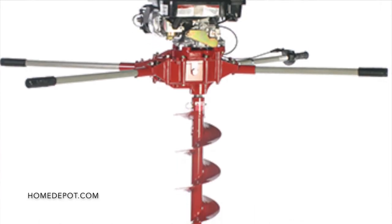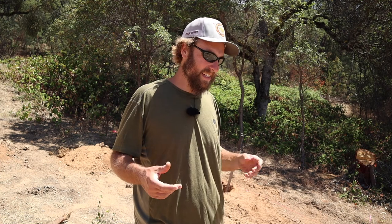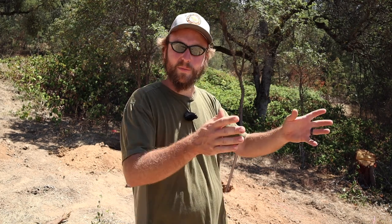And then your two-man augers, you're gonna be able to step up on your bit size a little bit, probably get a little bit more leverage with two guys pushing down and also holding. And that's gonna work better in your somewhat rockier soils and situations where you're doing maybe more holes than you would do with a single man auger, and it's going to be a little bit easier with two guys rather than one. And that unit is heavier than the single man, and it's a job for two people, we'll say that. The nice part about the one man and the two man is you can get it in between gates or in between buildings.